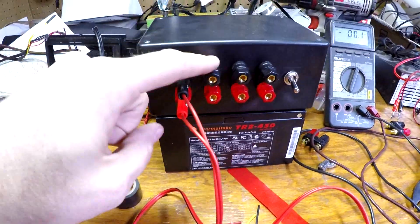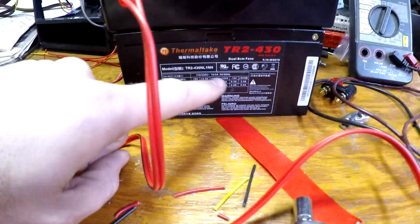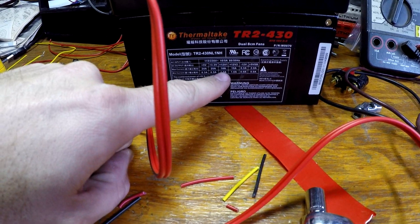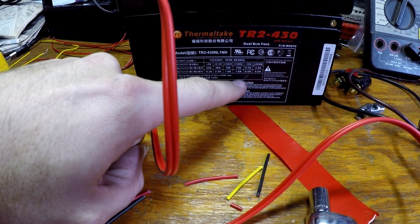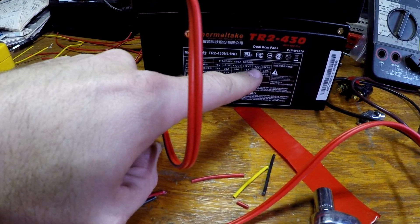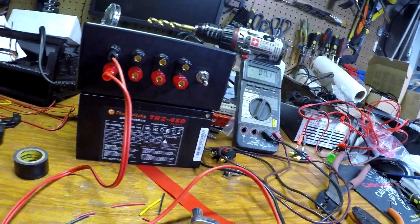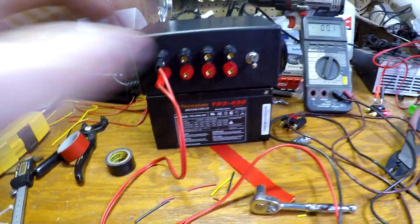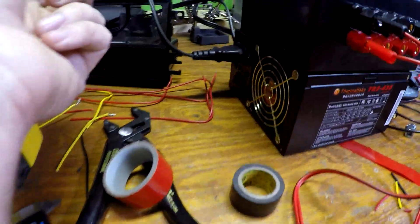Just a quick rundown: I have the multimeter hooked up. This should give 3.3 volts, 5 volts, and 12 volts. There are actually two 12-volt lines — 12V rail 1 is 14 amps and 12V rail 2 is 15 amps. There's also a negative 12-volt wire in there that I could technically use to get 24 volts, but a second 12-volt line is fine for now.